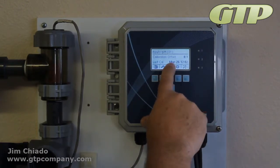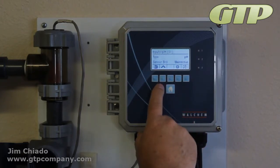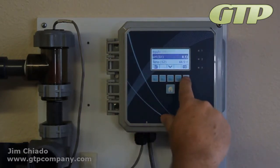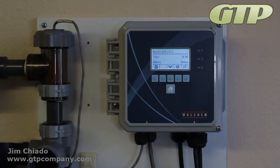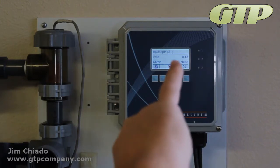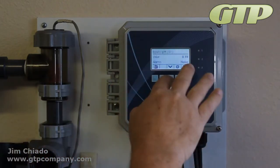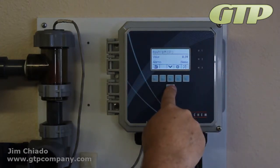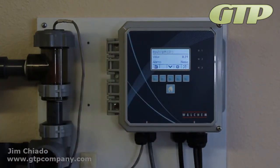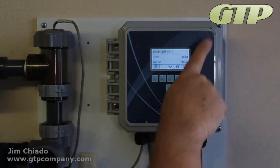You can see the last calibration I did earlier — type: sensor board universal. We're going to go back into pH. A one-point calibration is not always recommended because you're not giving it slope — you're not telling it how fast it ramps up from neutral. The scale goes from negative 1999 to zero and then back to positive 1999, so you do want to give it that scale or that ramp.